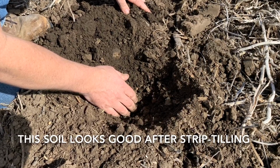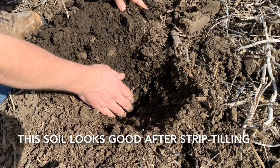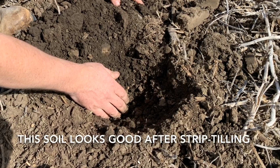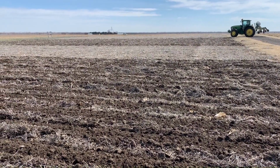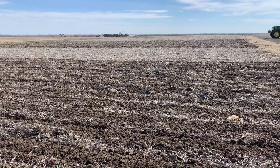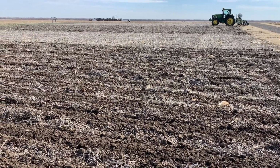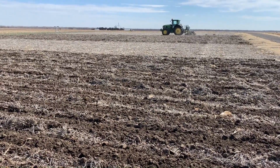In fact, you might be really hurting your soil conditions for later in the year if you're out there strip tilling too wet, just making some blocky structures, some massive structures along those shanks underneath the soil surface. And it really has to be on a field-by-field basis, because you can have some low residue fields where you might be able to strip till a few days beforehand, other fields that have a heavier residue, or there might also be differences between your sand, silt, and clay content that can really impact if a field is able to be strip tilled or not.